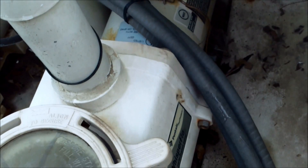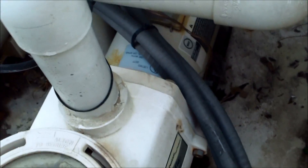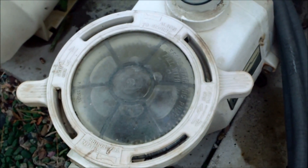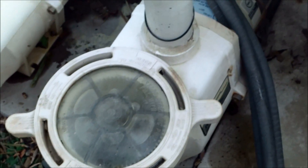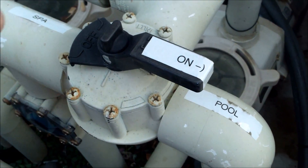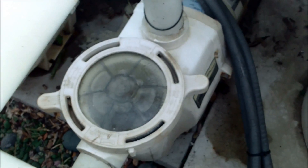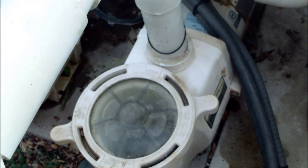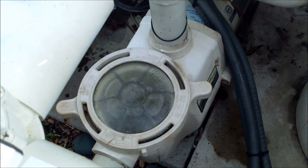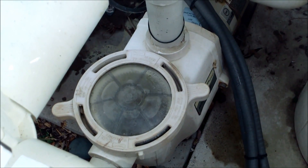You can see this will have a slight leak when the pump turns on. Any kind of air leak in the housing gasket, pump lid O-ring, suction line in front of the pump, or discharge of the pump can cause your system not to be sealed. Air getting in will push water back out through the valves and drain the spa down as well. Your system needs to be sealed when it turns off for the water to hold — any air or vacuum leak will cause that problem.